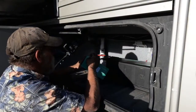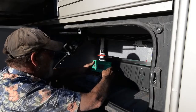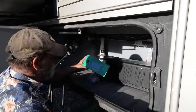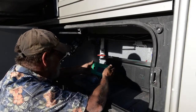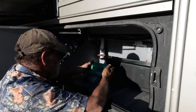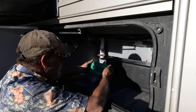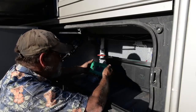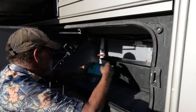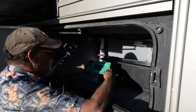We're at the point where we've hooked up everything. The unit is on and running. The solar panels on the roof are all plugged in and producing power to the inverter, charging the battery system and producing AC power for the house. I've got the monitor in my hand - right now the input AC from shore says zero because we're unplugged. Battery DC is at 12.5. The output load is 10%. Our AC is at 121 volts, 60 hertz on the inverter. The last things to do are seal up cable entry points, mount the unit to the floor, route the cable, and mount the monitor.